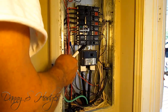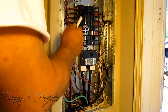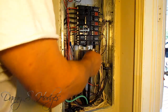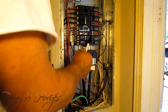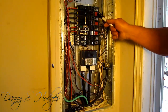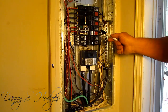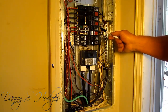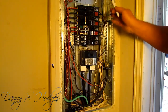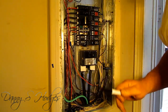If you need your appliances or your well or anything that runs off of 220, you're going to need a generator that'll run that. I'm just fine with the 110 and one half of my box working. All I had to do was move my breakers around. I've got all my lights, I've got the microwave, I've got the refrigerator, and here's my 110 air conditioner down here. I've got all my lights — I'm good to go as far as that. I just can't run any 220.